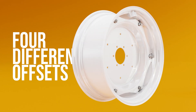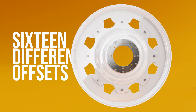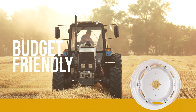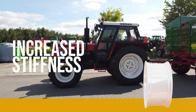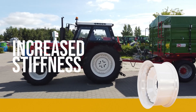You may be wondering which solution is best for you. Here are some facts gathered together. Adjustable lug wheels offer up to four different offset setups. Ring wheels offer up to eight. And Pronar Multifit offers up to 16 offset setups. For even more variation, you can use spacers. The undeniable advantage of adjustable lug wheels is their lower price, which makes them suitable for more budget-friendly tractors. On the other hand, ring wheels have increased stiffness due to the unique build of the wheel. Some configurations of ring wheels allow speeds up to 50 km per hour.